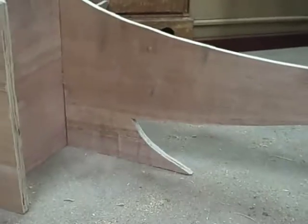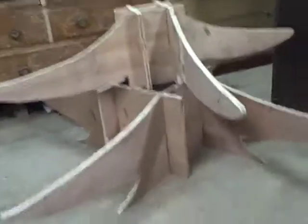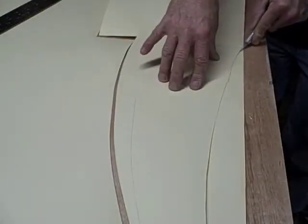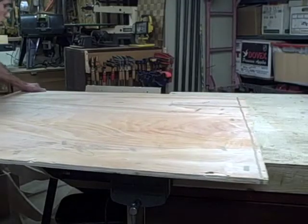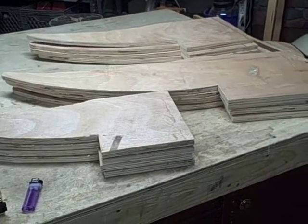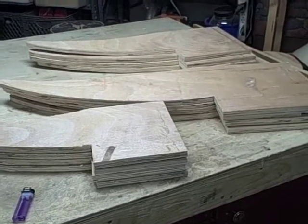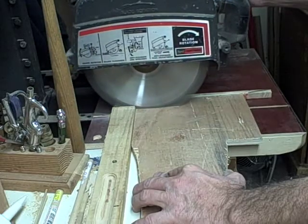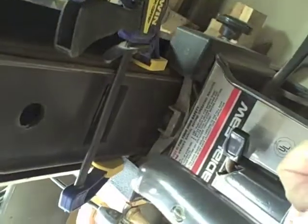The lowermost set are designed with a base. We've got the bottom layer and the leftover from cutting it. I've made all the measurements I'm going to need for the rest of the tiers and I'm going to make templates for them on this piece of paper. All right, we've got our Christmas tree tier outlines all cut. All we have left to do is put the slots in — we use a spacer and stop combination instead of having to measure each cut many times. We even set up a depth stop.